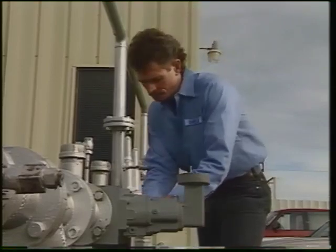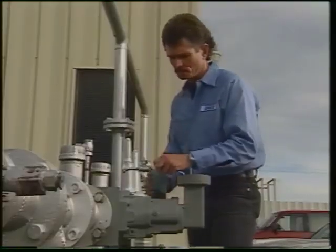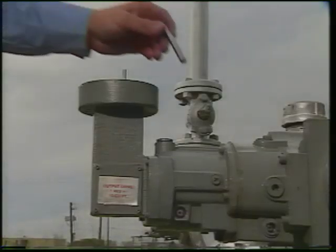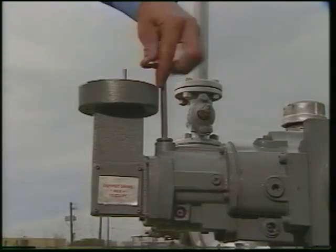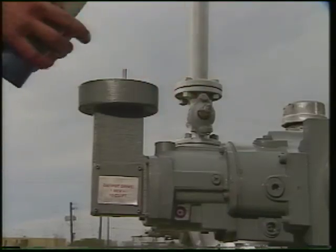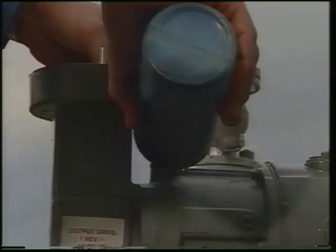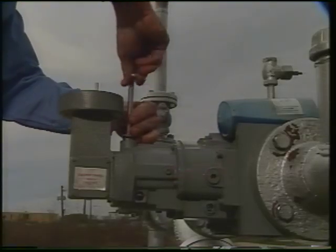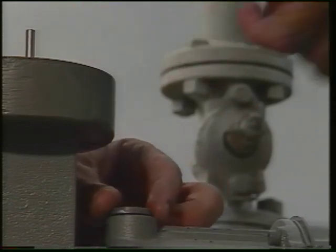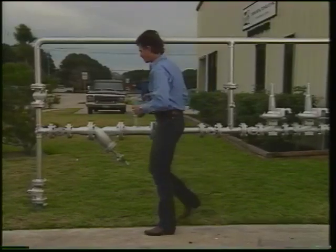The magnetic drive end cover is also a pressurized reservoir and is filled the same way. The instrument drive, or counter spur gear bearing sump, is also an oil reservoir but is not pressurized. The oil fill screws should be tightened to the O-ring seal on the screw and then turned 1/4 turn more to secure. Now the meter is ready to be pressured up.